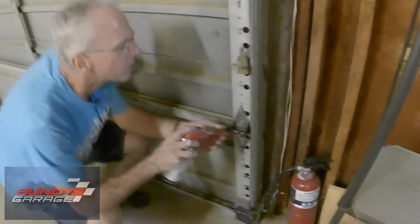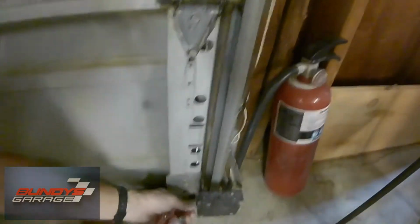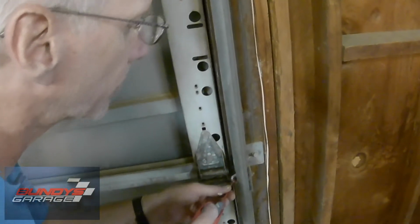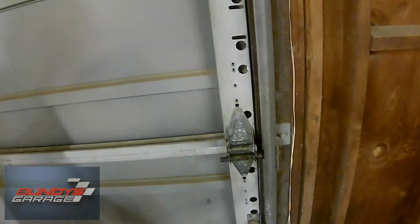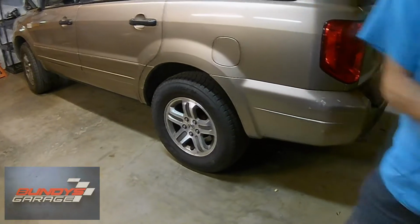Oh, now I got to get back to the wheels here. Make sure we get those done. It's not where the wheel's hitting, but it's where the wheel's rotating on the axle. So it's not the rail. No, it's not the rail. It's the axle. It's like you don't lubricate your tire and the ground. You lubricate the axle that's spinning around.